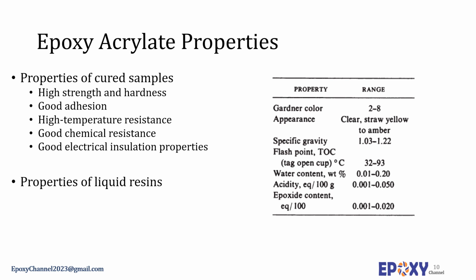Except for the thermal distortion temperature, the mechanical strain, tensile and flexural properties of cured vinyl ester resin coatings vary only slightly as a function of the molecular weight and type of epoxide backbone. Variations in co-reactant type and amount also produce moderate changes in the mechanical strain properties. Generally, these resins show good electrical properties and chemical resistance. They exhibit excellent acid, base, and solvent resistance over a wide temperature range in both resin castings and glass laminates.